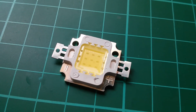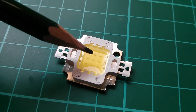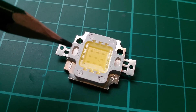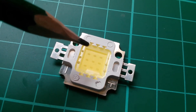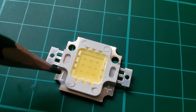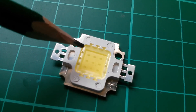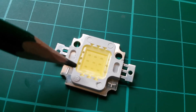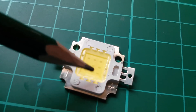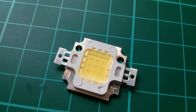This is a typical 10 watt LED. It has nine individual one watt LEDs mounted on a metal base. You could argue that this is a nine watt LED, but you can in fact overdrive these LEDs ever so slightly and put a total of 10 watts through it. They're wired in three columns of three LEDs in series, all paralleled together.